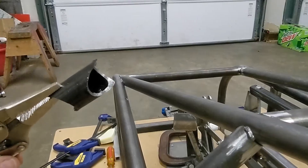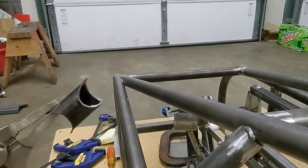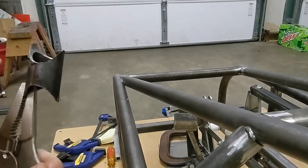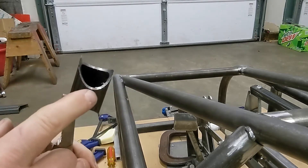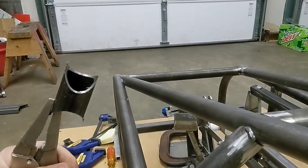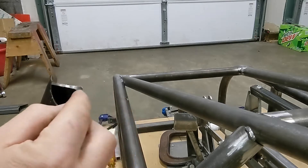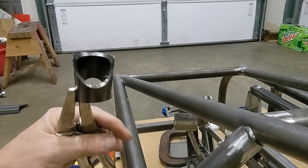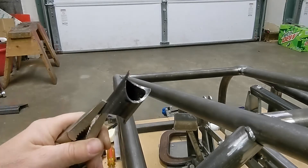Just finished cutting that little piece. You can see the mark and where it was cut at that angle. Now it's time to clean it up — this is straight off the notcher. You can see I've got my center distance off just a hair; I've got a little thin area of material there. I always like to grind all of my tubes down and open that up just a little bit, so that when you actually go to weld things together you're not trying to weld to basically an ultra-thin piece of steel. I want to get into the meat of the tube so we can get a really good bond between the two pieces.